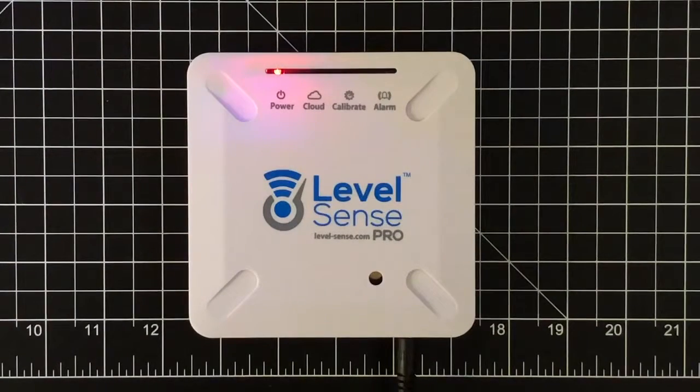We're going to wait until we get a green flash of the cloud light. It's going to go solid right about now, and the other lights are blue — meaning that we've asked the server to initiate a firmware push to the device. Those other three lights are blue, the cloud light is still green, and we're going to wait for it to give us another flash. The cloud light is going to go out here in a moment.